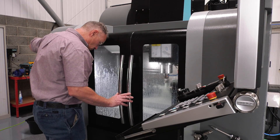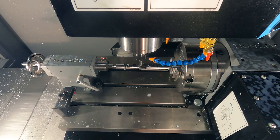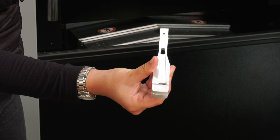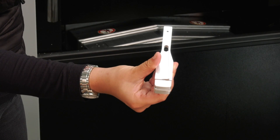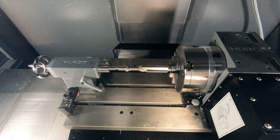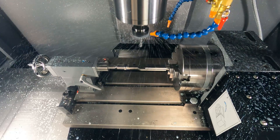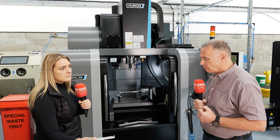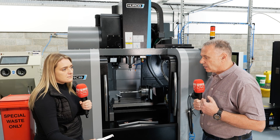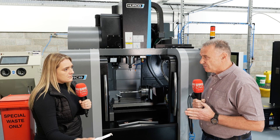Correct. The reason that we are — because we're only making prototypes — it makes sense to machine that on the fourth axis. We can rotate this round 90 degrees to machine a slot, a pocket, then rotate it round another 90 degrees to machine the other pocket. We can then profile it. So it makes sense to do that in a prototype scenario. In a production scenario, we would probably do this in a vice where it's more rigid and robust. But for prototypes, this makes perfect sense.